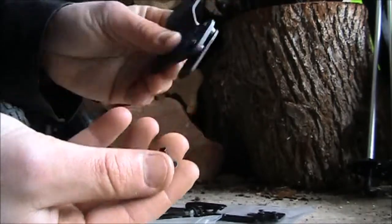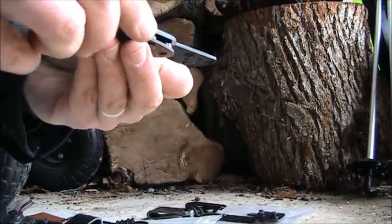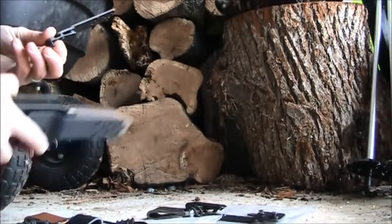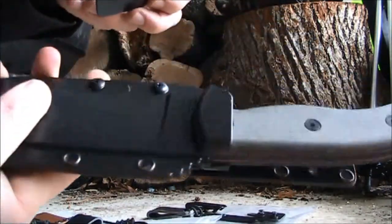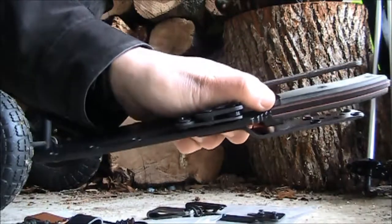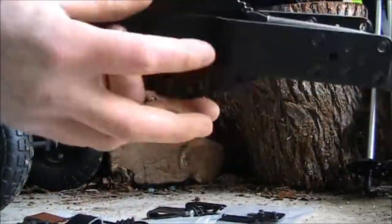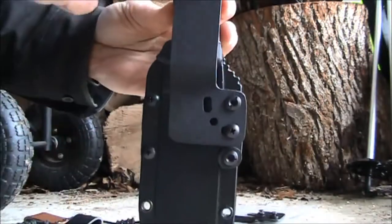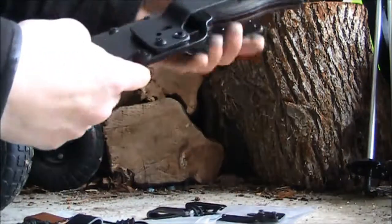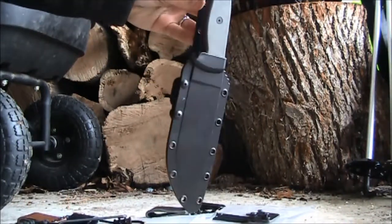The pillar that you removed from the lower hole will go with the washer. The washer can be on the far side of the sheath or on the inside of the sheath — it's just there as a shim to make proper spacing for the second pillar. You then mount that to your sheath. You can see that the extension will sit right on your sheath like that, and you just adjust your angle of lay, whether you want it slightly angled or just in line with the handle. This will work on any sheath that has spacing at 1 1/2 inch on center.